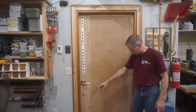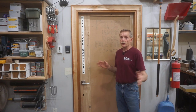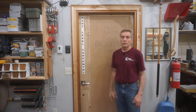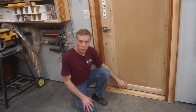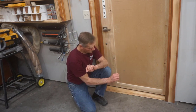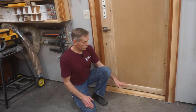That one remaining thing is to put a door bottom on to seal up the gap between there, to keep dust and noise on this side of the door from migrating through to the other side. I can only do that when the door is off, so that's the first thing I'm going to do. Because I'm showing off the beauty of this pallet wood and I've got a wooden threshold, I don't want any part of that door bottom to show when the door is closed. Because I designed this with a half-inch gap under there, I couldn't use a standard door seal, so I had to customize one and I'll show you that in a little bit.